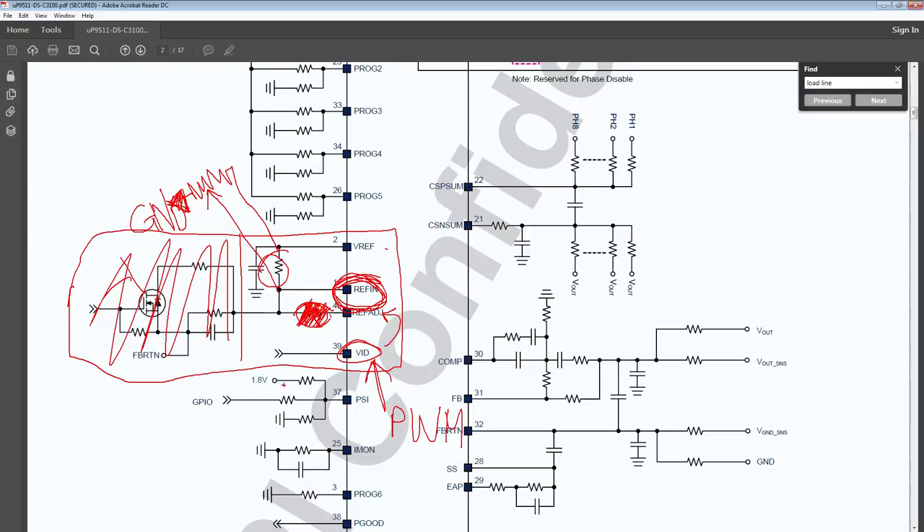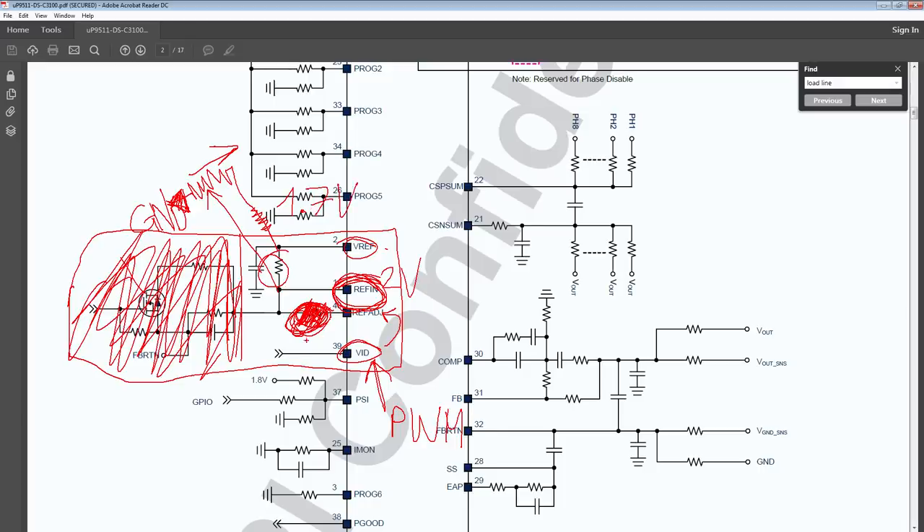So you'd remove one or two resistors, and then set up a potentiometer between VREF and REF IN. If you don't want to blow up your GPU by accident, you're going to want to put a resistor between VREF and the input of that potentiometer, because if you turn the potentiometer all the way, you'll have two volts at REF IN, and that's going to send two volts to your GPU core and kill it. So put a resistor to limit yourself to around 1.7 volts if you're on liquid nitrogen — calculate what size resistor you need for that.